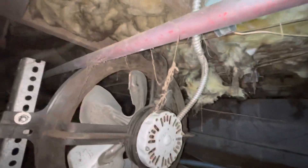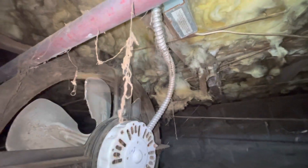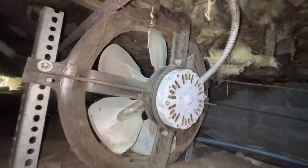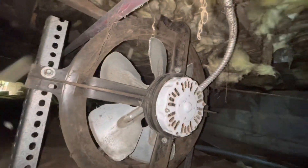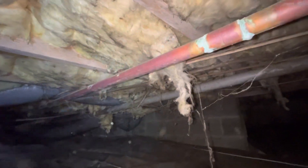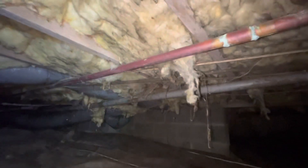This second ventilation fan's shroud is not protected at all, and I can see where the insulation is starting to come down. This insulation is probably going to continue to come down little by little and get pulled through the fan. At some point, think about having the insulation replaced — it doesn't last forever. I also noticed these copper pipes, which are great, but they really need to be supported to the joist — they're just kind of hanging there. I'd recommend going through and putting some hangers on them.